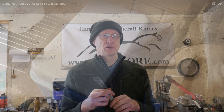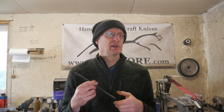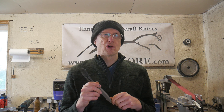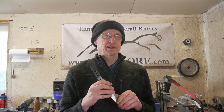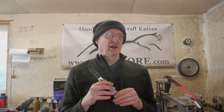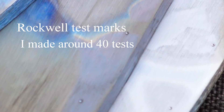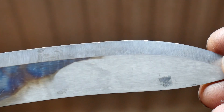I tempered them at 220°C, and it didn't alter the Rockwell hardnesses one bit. Increased the temperature to 250°C and tempered again for two hours — that brought the hardnesses down one point to about 62 to 62.5. Tested the blades: extremely chippy. Retempered at 315°C for two hours — no differences in the Rockwell hardness measurements. Tested the blades again: chippy, chipped very easily.